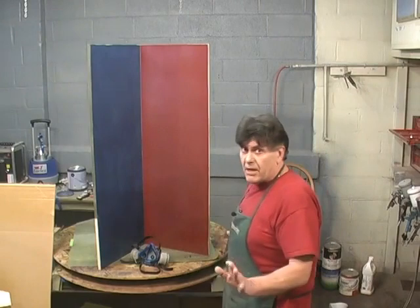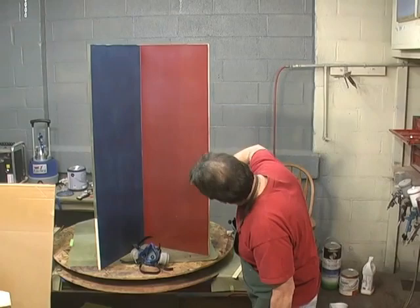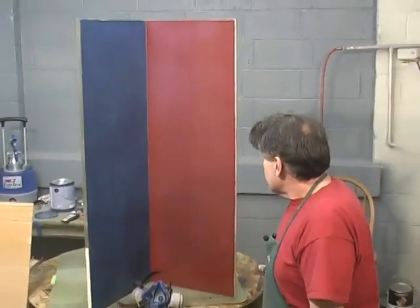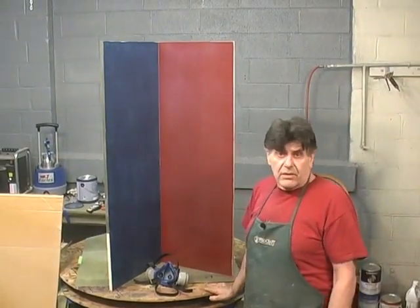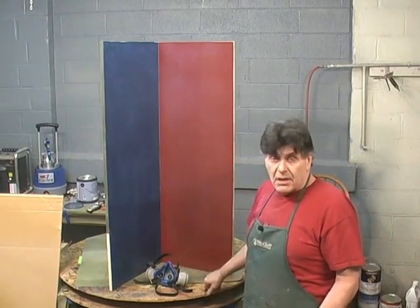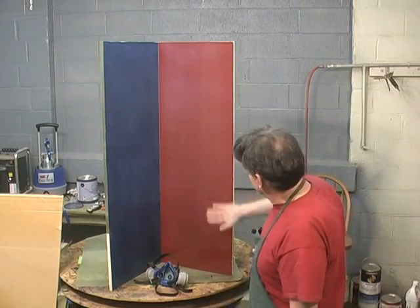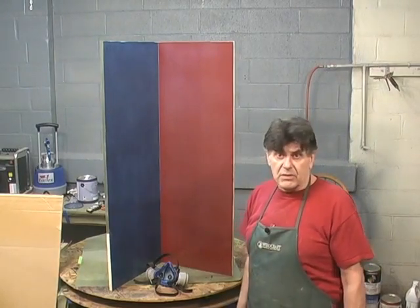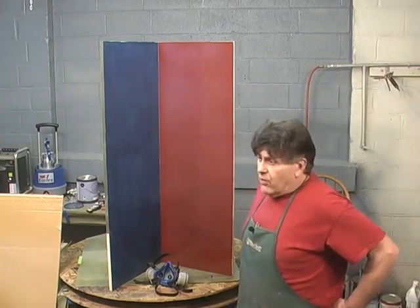All right, it's just been a matter of minutes. I've got the nozzle changed. I want you to look at this. This is all but running, just before running. Now that'll level out a lot, but is it going to give us a smooth surface? No. So what do you do with that? Name one thing you can do. Watch it, don't let it run. Let it dry, sand it back. What does that mean? It means you're going to have to take some 320 and sand it back nice and smooth, back up and reevaluate, and at some point I will assure you four letter words will be involved.